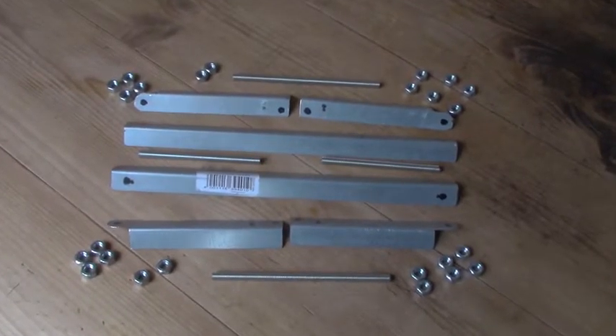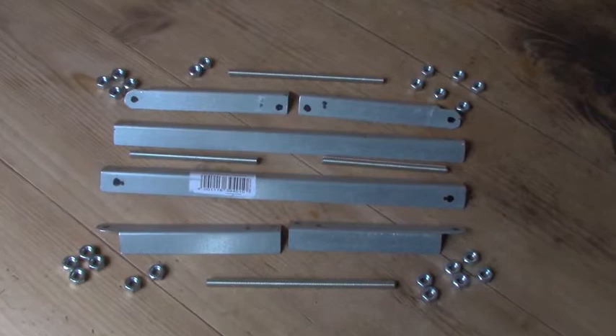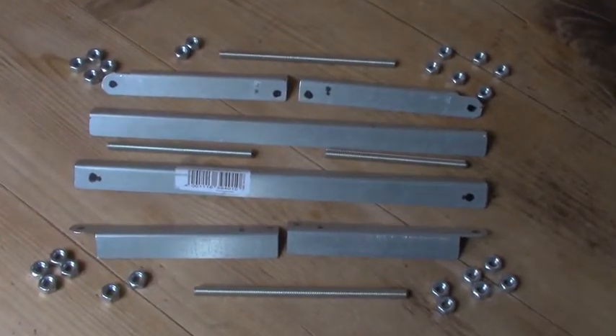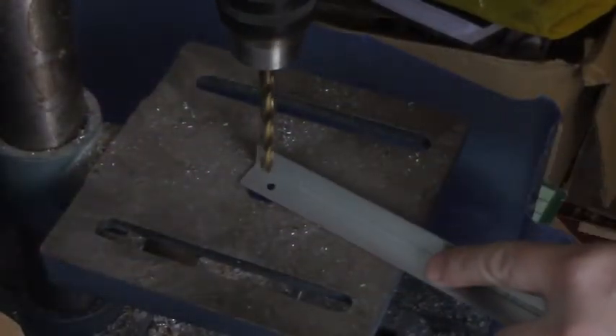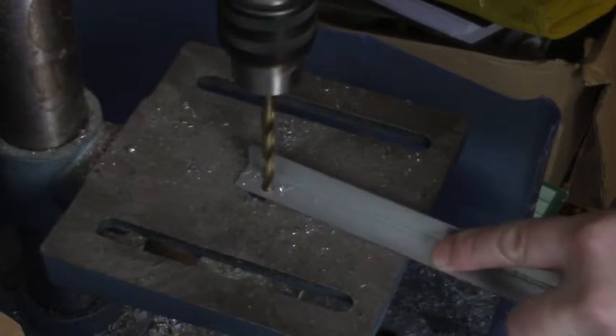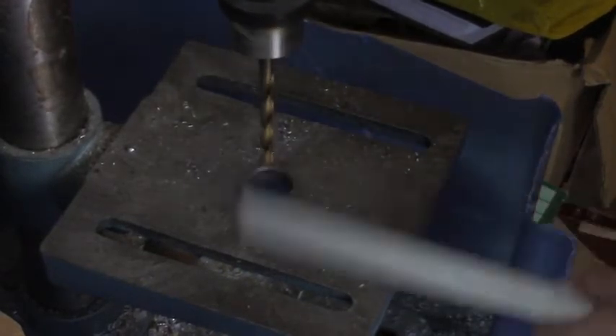Here's all the pieces cut. I haven't drilled the holes yet — that comes next. But you can see all the pieces of the grate laid out. I'm using a pillar drill, nice and quick. If you use a power drill you'll need to use something to stop it skidding everywhere, or drill a pilot hole. It's all explained in the handout.